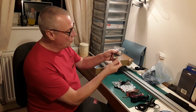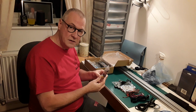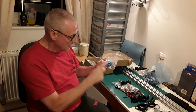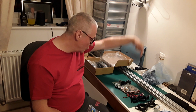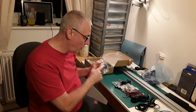We've got a normal electric motor that you'd have on your RC plane. Speed controller there. That is to drive the actual cutter that's going to do the business, hopefully. I've got one of those cheapo servo testers. We've all come across these in the past, no doubt, with a 9 kilogram servo. The servo is to lift the Z axis up and down. So once it's finished its cut over this side of the board, it'll want to lift the cutter out of the way so it can drive over to the other side of the board, drop down, and continue cutting whatever it's doing. So that's for the Z axis. The servo tester, by the way, is to control the speed of the motor as well.